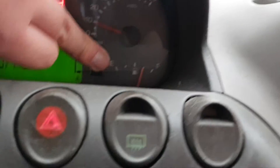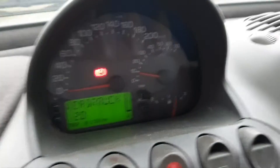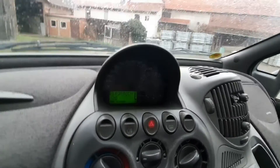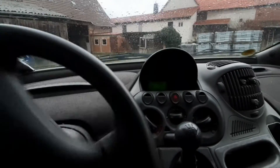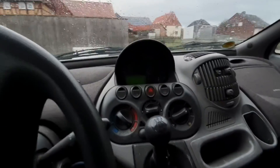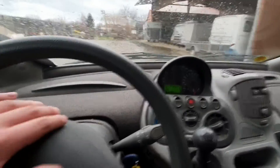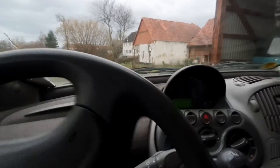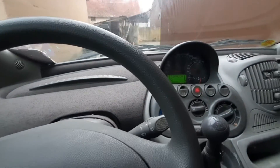The RPM drops quite a bit. Ah, this damn door. Yeah, you see? 2 liters — that's already a bit too lean. I'd say we drive back to the hiding spot now before we get the servo problem again. We're lucky today — we have a full spare battery. That means if it cuts out, we can definitely get it started again. But that was definitely too little fuel. It's showing 2 liters now — that can't be right. It must be at least 8, 9, or 10 liters while we're standing here. The problem is there are trailers parked everywhere, so we can't get back in from behind. We have to reverse with the steering turned. He will 100% cut out again — the fault search continues.